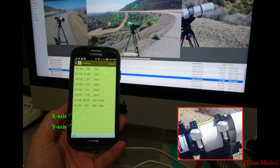Now I discovered that the two parallel surfaces of the rings that hold the telescope, as you can see in the lower right, are not exactly parallel. And so the inclinometer would toggle slightly. As you can see there, you can form two triangles that would be flat, right? 3 points specify a plane. And so because the two ring surfaces on top were not quite exactly parallel, the inclinometer would toggle slightly. And so then once I discovered that, I paid more attention to it after site 3. So anyway, I went back and redid site 1 and 2.